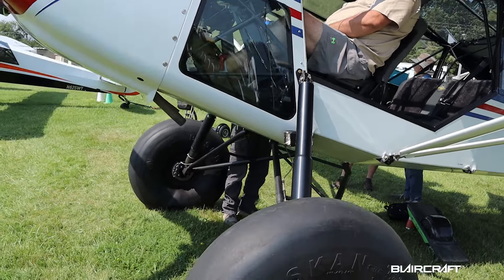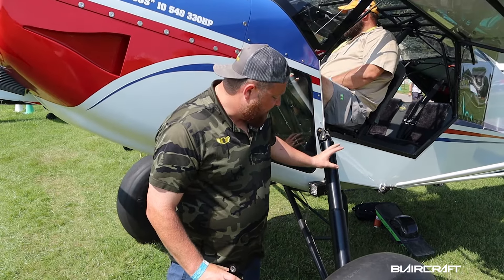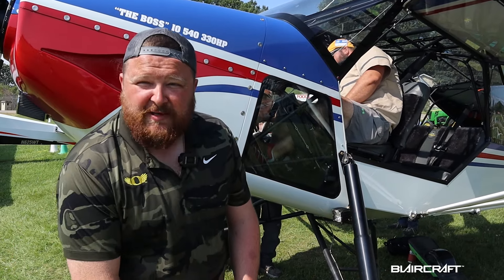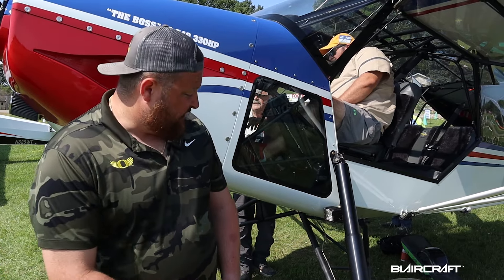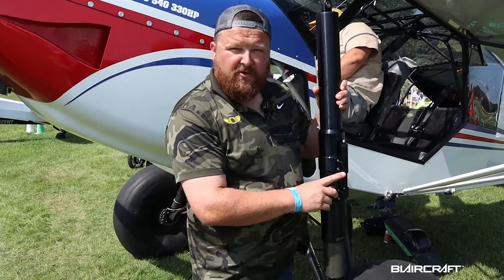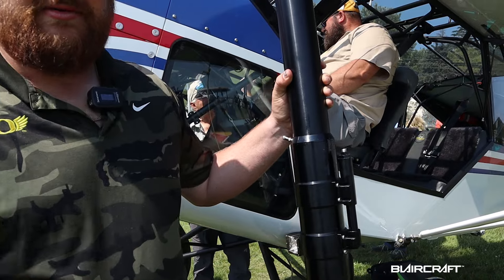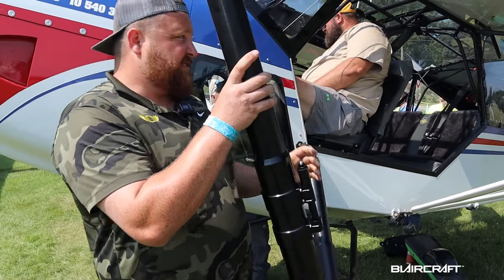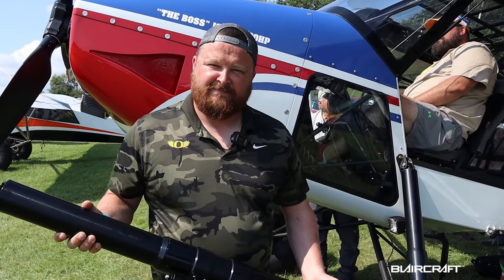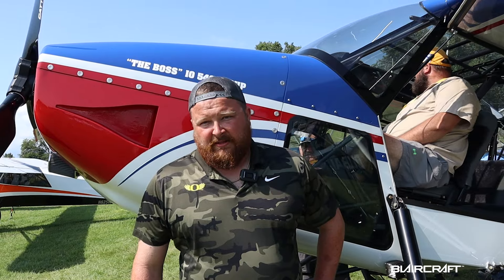The suspension looks pretty impressive. This was the first swing at the new suspension — Tony at TK1 Racing built it for us. Our biggest challenge was upping to a 3,600-pound gross weight in an extreme off-airport environment, and that kind of suspension had never been developed for airplane use before. Tony developed this first set, which met our needs, then took it one step further with an external reservoir with rebound adjustability. We can now adjust the rebound of the shock externally during flight testing. Previous designs required sending the shock in to get it revalved, but with this new design you can tune it in the field.